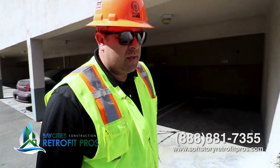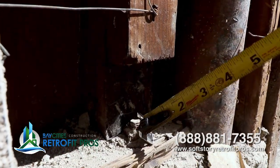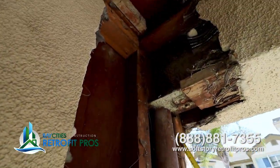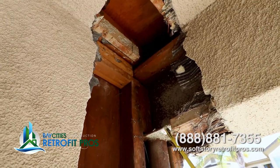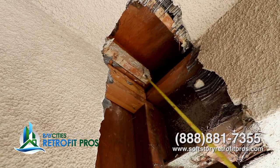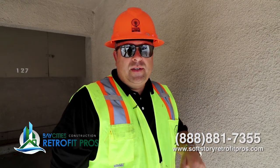Let's go over to the corner and see what it looks like. This thing is notched — pretty much every joist at the end of the shear wall is notched for this little nut and bolt. Here you've got your pipe column connecting to your I-beam, and you've got a mechanical connection that was welded. The next thing we're looking for is this connection at the top of the wall, and ultimately what's the quality of the connection between the top plate and the floor joist for the second floor. We've opened up a couple of other sections on the other side of the building — let's go take a look.